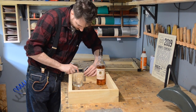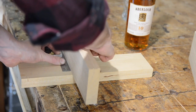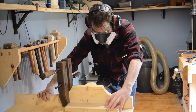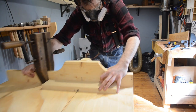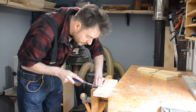I dig out my favourite bottle of scotch and work out where I need to cut some grooves. If you really want to treat yourself, the scotch is on my Amazon page too, under the Father's Day section. With it all marked out where the grooves need to go, I can use a stop and my cross-cut sled to make the cuts, just nibbling away at them. As I only need to make a few cuts, I didn't swap out to my flat tooth blade, so I had to get a chisel and just clean up the cut a little.